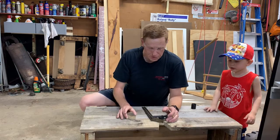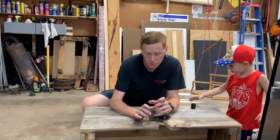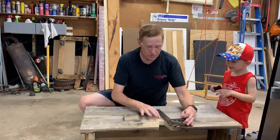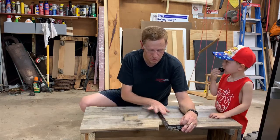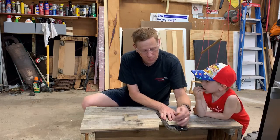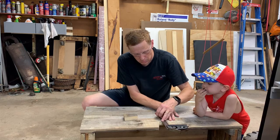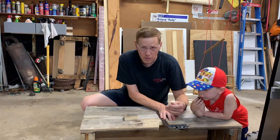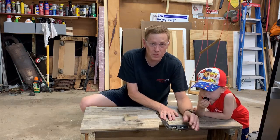As you're working on these pieces, make certain you keep center lines of everything. I have the center line drawn completely around this block, and I also have a center line going down here. I'm going to continue that further down, because all the measurements are based on the center line. Then we'll get out the templates of where we need to drill holes and the other pieces we need to make.